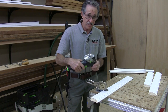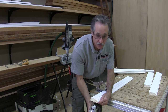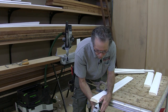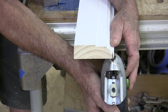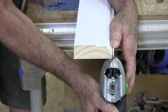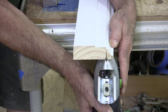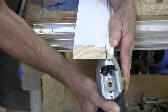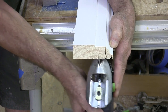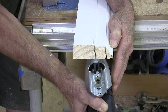Remember, I'm going to use this at first in the pull position by pulling it right in to where this little overlapping miter is going to be. There's that little overlapping miter right up to the paint line. And then we'll make another fillet cut right here, this little leaf cut. Rocking that tool all the time. Don't just push the tool. If you just push the tool and don't rock it, you'll cut too far.